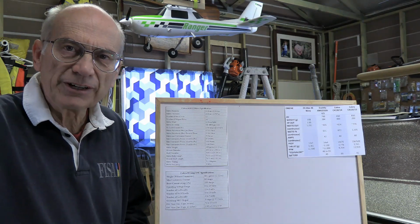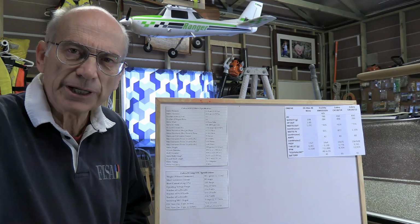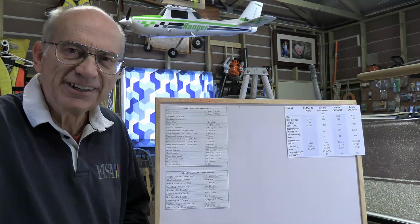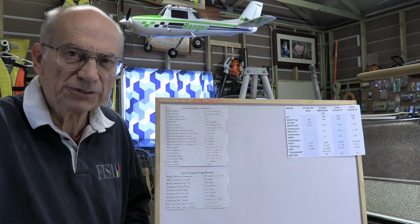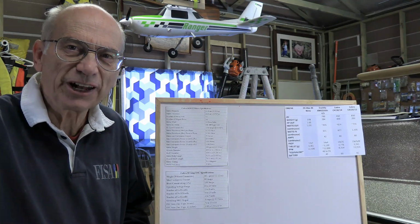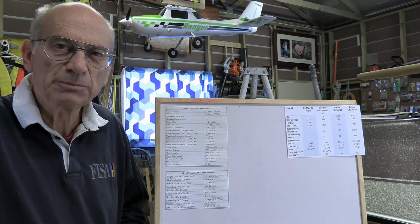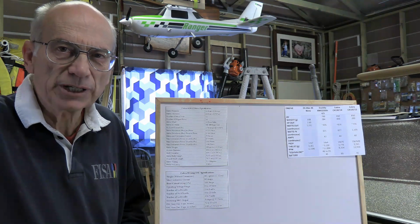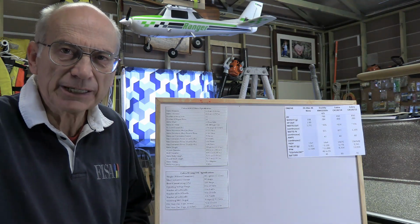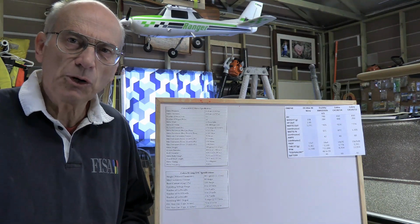There's one other matter that I found rather confusing, and that's called active freewheeling. Now, you get confused easily because there's at least one manufacturer that I found that refers to the prop freewheeling as being the brake is off, okay? But active freewheeling is not talking about the brake on the prop. It's actually talking about the electricity inside the motor.